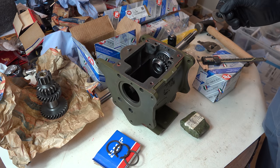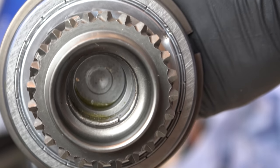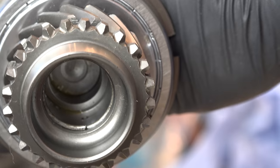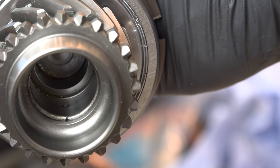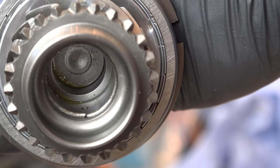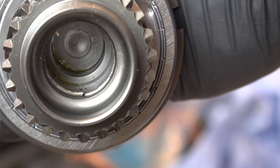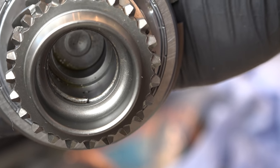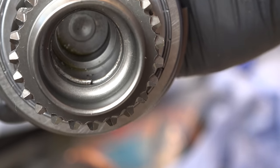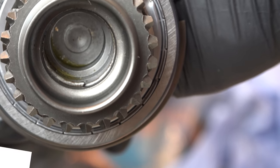Here's the first problem - it didn't take long. Look at that - that's the snap ring which is supposed to go in there. You can see it's in there but it's overlapping - they haven't left enough space between the two ends to actually get the thing to fit. I've got to pull it out again and cut it back a little bit. This is what I'm talking about with parts - you get a snap ring supposed to go in there and it's not right. This is what you've got to deal with.